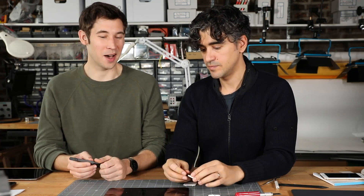This was an interesting product because of the removable battery. After four generations, they chose to go from a non-removable to removable. In a lot of modern tech products, you see either the reverse happening or no consideration of that. A rechargeable battery is something they could have used, but that would have increased the size and cost even more to include a USB charging port. For something that's supposed to last a year, self-discharge becomes a really big issue with LiPo batteries, so this lithium chemistry is more appropriate. For the product designers out there, these are common struggles — what feature is more or less important — and the only way to really know is to learn over time from how people are using them and respond to that.